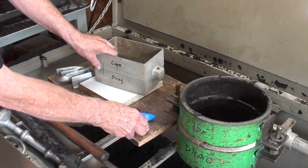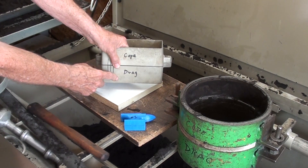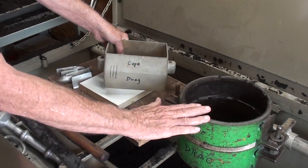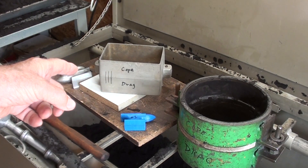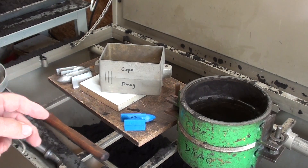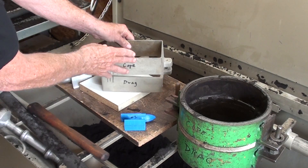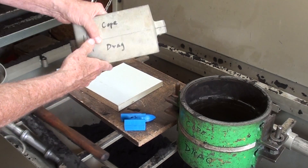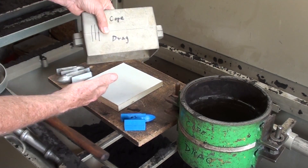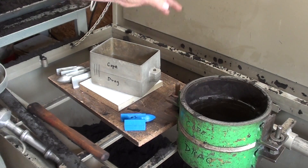I'm using a different flask — a little aluminum flask. I don't think I've ever used it. The top part is called the cope, the bottom is the drag. It's even smaller than this one. It was perfect for use in a junior high because a small boy could handle it and it didn't take much sand. The thing I don't like about it is that there is no rim in here or any way to retain the sand — it could literally slip out if you're careless.